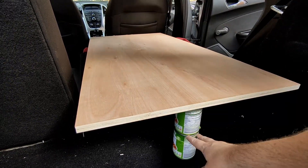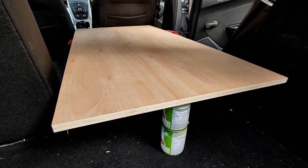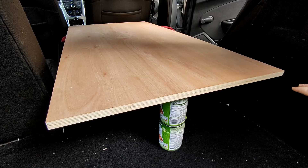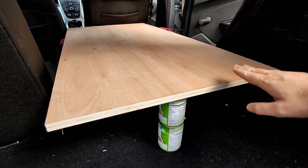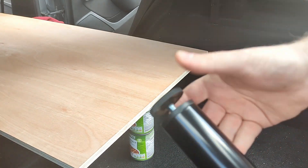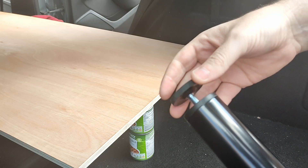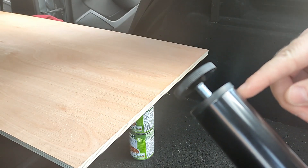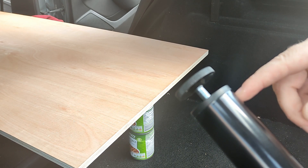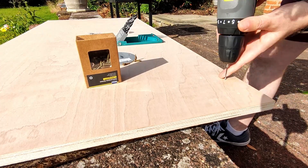Just a reminder of the approach: one end is just going to be cushioned against the seat. I'm not using soup cans for the legs — I'm using IKEA legs from one of the IKEA tables. They're adjustable and I should be able to cut them to size, then use the adjustable section to lift this end up and down. If you rotate the end it's on a threaded section, which unscrews to a total usable length of around 18 millimeters. I'm going to chop them to height and have one there and one there. Now it's time to actually do it.